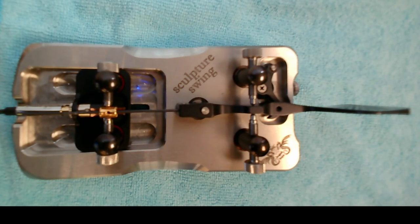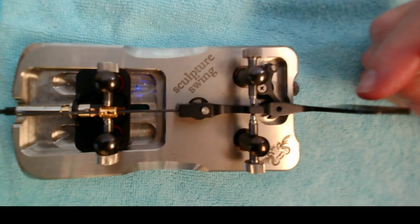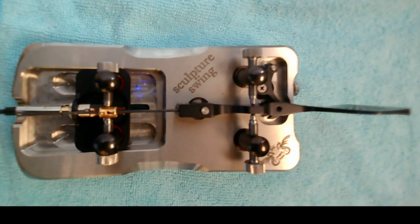Possibly the greatest strength of the design of the Sculpture Swing is the range of adjustments that are possible. On many keys used as sideswipers, the paddle comes to a hard stop when the contacts close — it's like hitting a wall. Some of us like a more fluid, softer landing where additional motion is possible after the contacts close. With the Swing's design, the amount of that additional over-travel is user adjustable, as is the contact spacing and how hard that additional movement is felt. This can be especially nice if you're new to sideswipers or if your style of sending evolves — the Sculpture Swing will evolve with you.